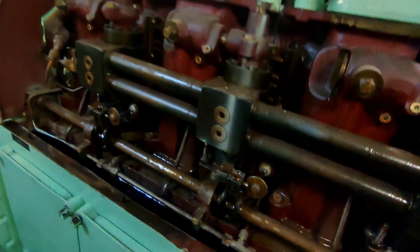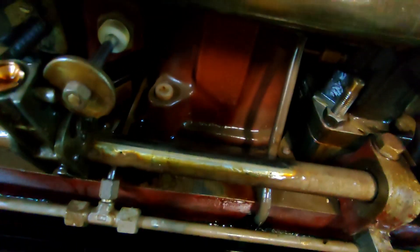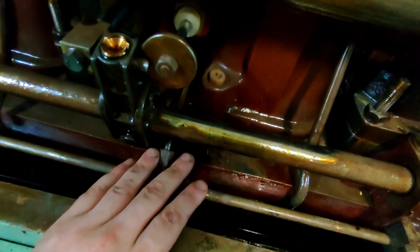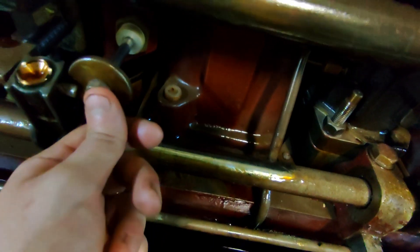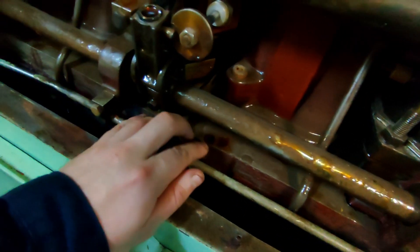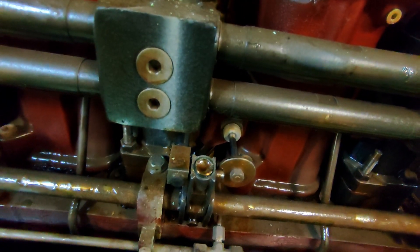What we want to do is go through every unit, push all the indexes in, make sure nothing's moving. And secondly, you want to be checking for air leaks. Normally the solenoid valve for this is closed. When the stop piston is activated, the solenoid valve opens, air flows down these pipes, pressurising the piston to come out. So with my hand I'm just going to be checking for air leaks on all the connections, check that you can't push these in, and if all's okay, then we know that's working as it should.